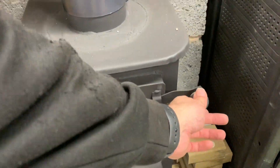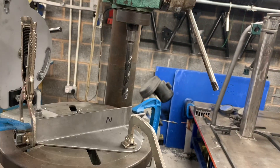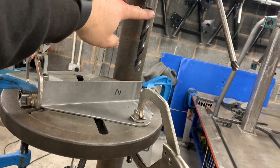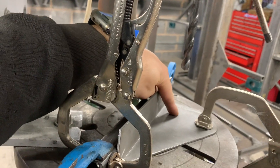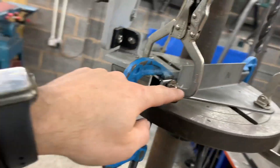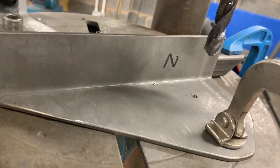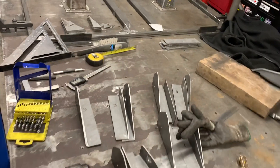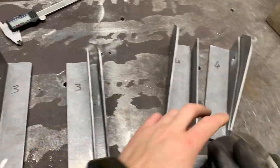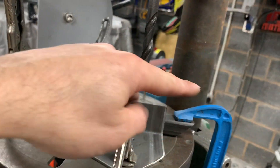I'll just give you a quick look - oh, she's ripping away now. The setup I've got here: we piloted with the 5.5, this is a half inch. What I did is I put the 5.5 back down in the hole and I put a backstop, and then this one's acting as an end stop. So I'm just slotting them in and they're all right in the middle. I'm doing all the right side first of all the sets, and then I'm going to flip the jig.